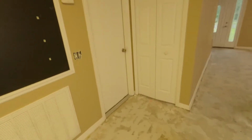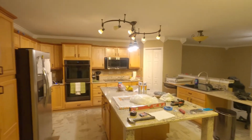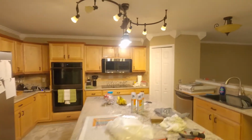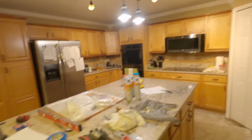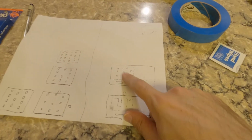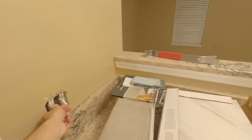So switching, I don't want to change the switching too much in this house because it's more electrical work for the electrician. So I don't know how to wire that, because basically this one switch right now turns on all of that. So if I use the same existing wiring, this island is going to be lit up as well as these 3 lights here. These 2 lights would be wired into where this light is now, which is this switch right here. Which is fine, because I like doing that anyway.